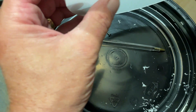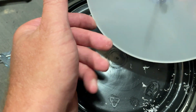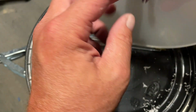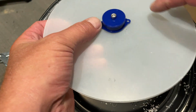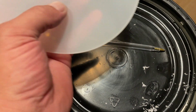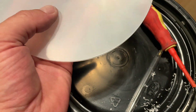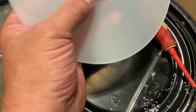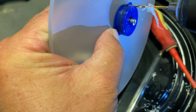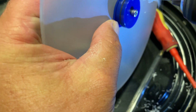And I also haven't applied the CT1 yet, for the same reason. We'll do that as a sort of last job. We will take that back off, apply the CT1 as a final phase of work, and refit the air admittance valve. So I'll drill the last hole, having lined it up.